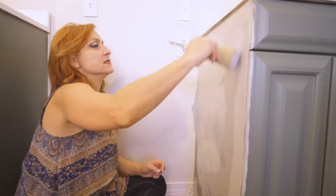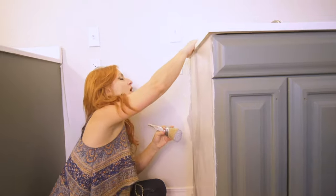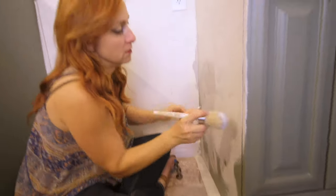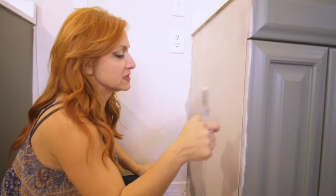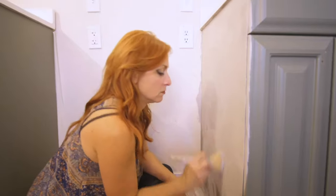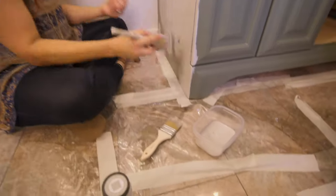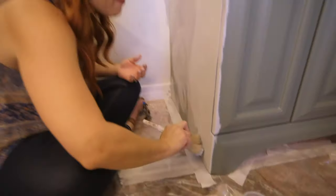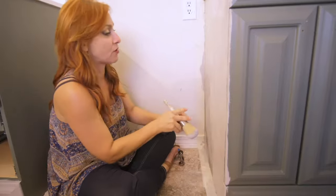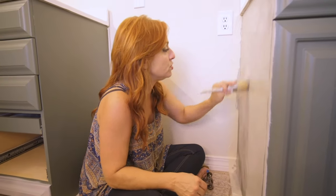Something important about chalk paint is it's very thick. If you put your paint on too thick, you're going to get a lot of brush marks that are really deep. When we go ahead and put the second coat on, it's going to fill in some of the grooves created by the first coat and smooth it out a little bit. If you really want a smooth finish after you have all the coats on for sufficient coverage, you can come back with some fine grit sandpaper. As long as you don't wait a couple of days — just wait till it's dry — sand it and it comes out so smooth. It's a beautiful finish.